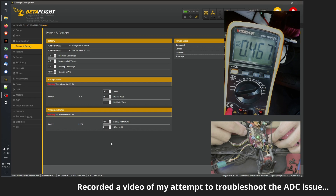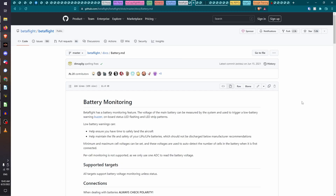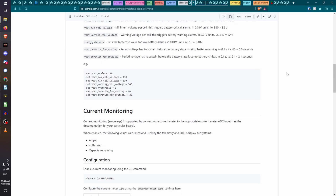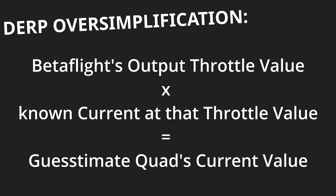But what if your ESC does not have this current sensor chip, or if you have issues with the onboard ADC? The next best thing is what's called the virtual current sensor. Betaflight's virtual current sensor works by guessing the amount of current the quad is pulling by looking at the throttle value the flight controller is sending out to the ESC — not the throttle value your stick is at. When a quad is in flight, the throttle value the ESCs are receiving might be significantly higher or lower than your stick input, due to the PID controller trying to balance the quad. It can infer how much current the quad is drawing if we input a known current value for a specific throttle value. It sounds complicated, but it works fine enough for what it's trying to do.